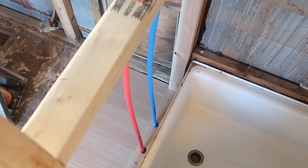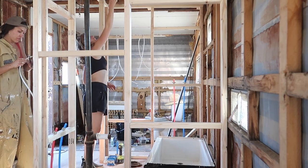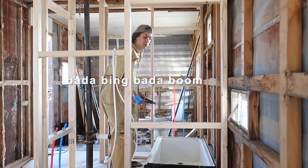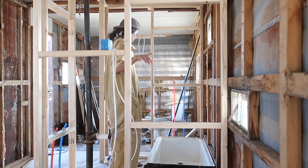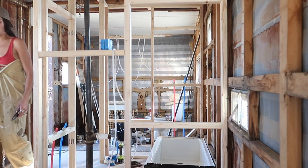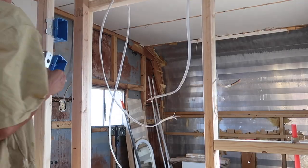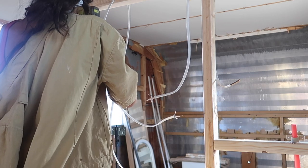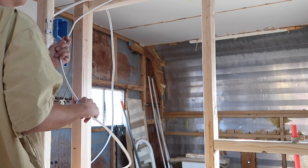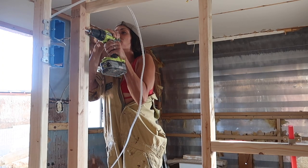We started with plumbing because it was the easiest, and now we're moving into electrical boxes and extending the electrical into different areas of the bathroom that it wasn't originally in. I have three strips of wire down and one little outlet. I started cutting and stripping all of the wire for Lindsay and hanging it over the frame. I even hung the outlet boxes where I wanted them to go — the ones with the metal are adjustable once you put the drywall on, which is really nice.